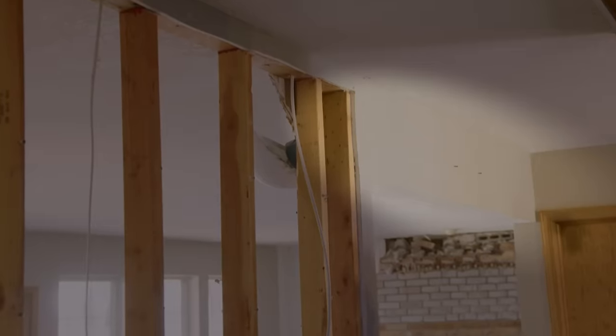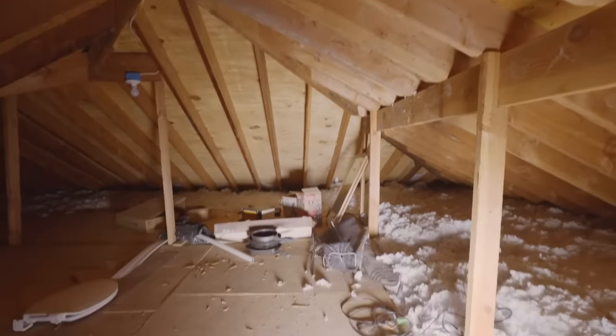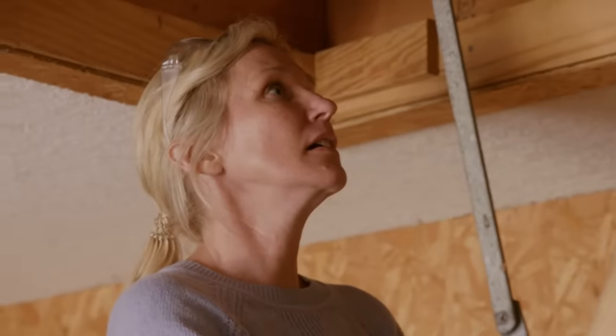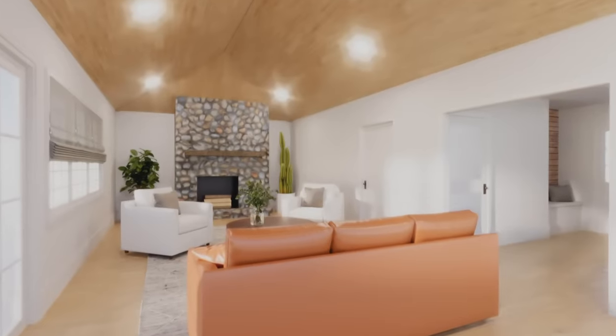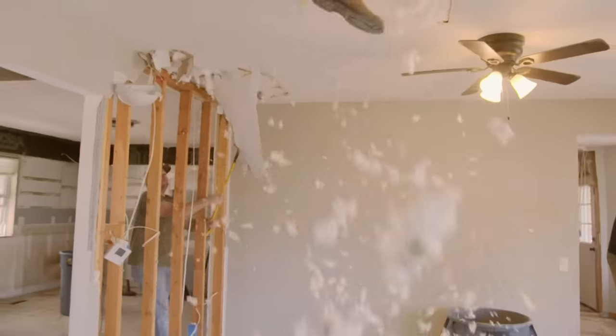We're really trying to open up the kitchen to the living room, but that beam is right in your face. I think the only way we're going to fix this is, hopefully, we have trusses upstairs where we can remove the beam. Jenny, it's not really looking that good for losing that beam. So it is all open rafters, as you can see. This is pretty. Hey, what if we did this? The beam has to stay below the wall — unless, if you look up here, I've got tons of room. I wonder if we could just take and vault that whole living room. Then we could set the beam up here and just do a vault. Oh my gosh, it would be amazing. It would give you the whole cabin look. We've got nothing but good news — and that never happens. So we have rafters, we have a stick-built roof. And what can we do with this roof? Raise it. Raise the roof.